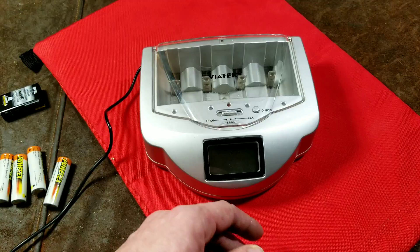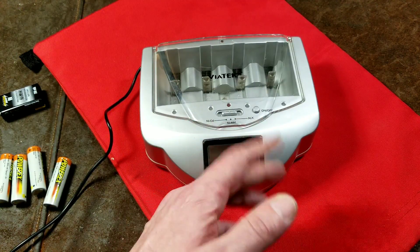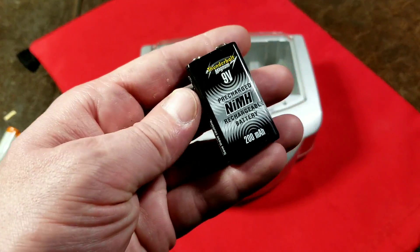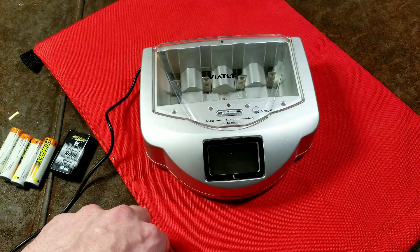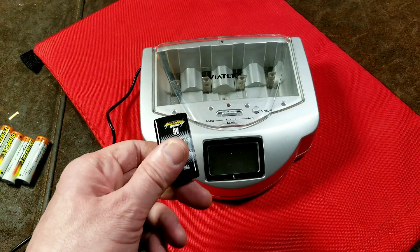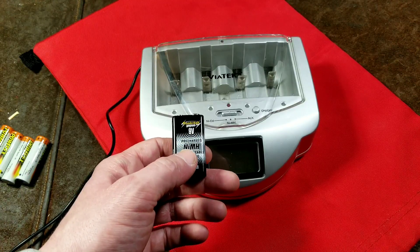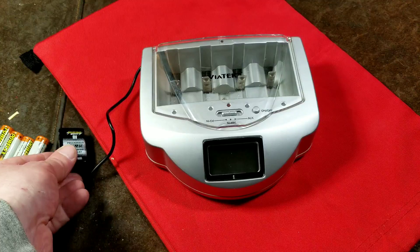Recharging alkaline batteries really is smoke and mirrors. You really need to get things like nickel metal hydrides — and modern nickel metal hydrides are awesome. They're pre-charged, they don't discharge when sitting in the drawer for months, and they can be recharged hundreds of times, especially if you just take care of them a little bit. Don't let them bake in the charger for days, and don't regularly top them off when they're pre-charged — only charge them when you've actually discharged them and need to put some energy back in.